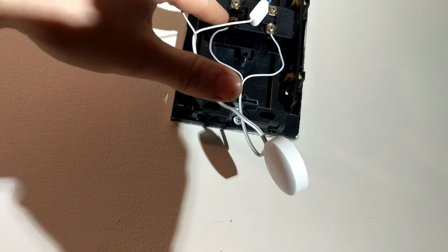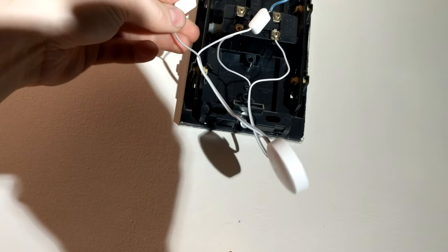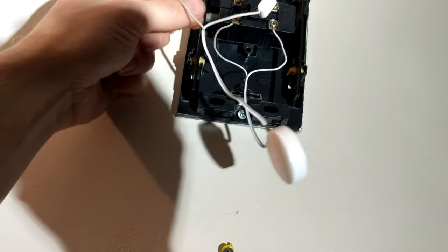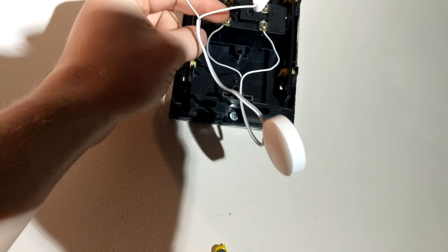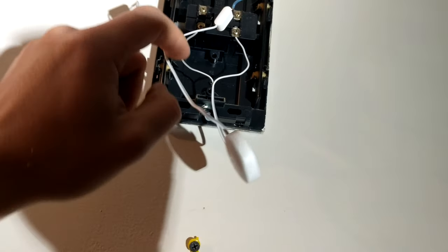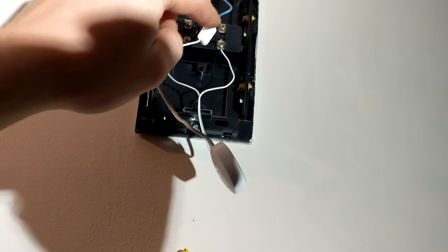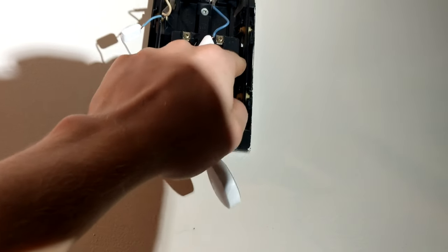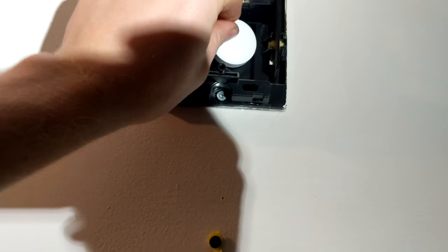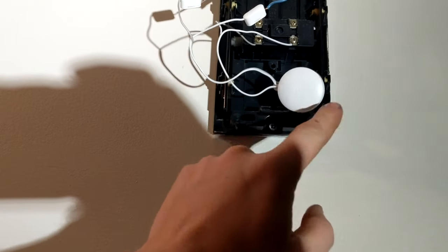We also have two wires directly connected to our chime, so we know it's a two-wire system. When the app asks, it's just asking about the ones connected to the chime — if you see a wire nutted up here, don't worry about that. Take the wire off, slip it into the gray connector, then take the gray wire coming out and put it on the chime terminal. The wire that used to be on the chime is now going through the Nest and back through the gray wire — it's just a continuation circuit. Do the same with the white wire, screwing it on. Then peel the sticky backing and place the connector inside, finding a flat surface.